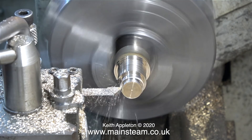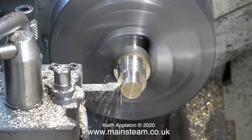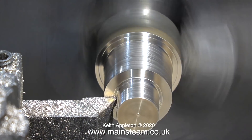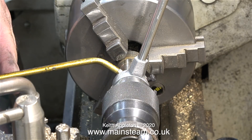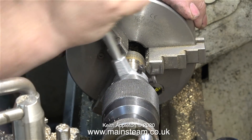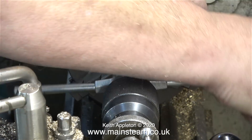The cutting tool I'm using is not particularly sharp. These tips are okay, but you have to change them frequently, and this one is about ready to be changed. This is a shot of the final cut, and now this center piece is exactly half an inch in diameter. All I need to do now is thread it. I'm using a standard manual die holder, and I'm using the tailstock chuck to keep it in line with the work. I really need to make an adapter for these larger dies that will fit in the tailstock chuck and support the die holder a little more securely.